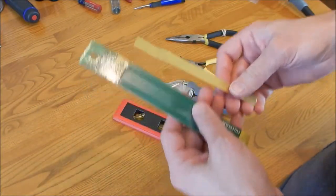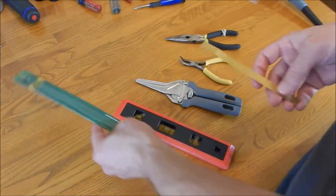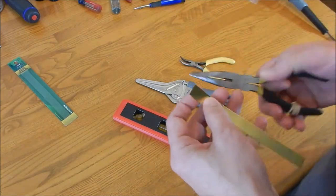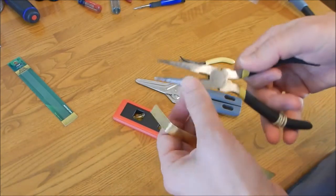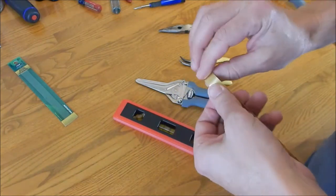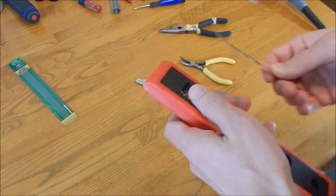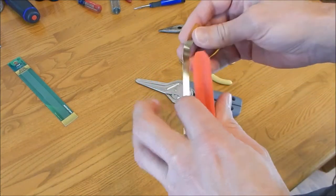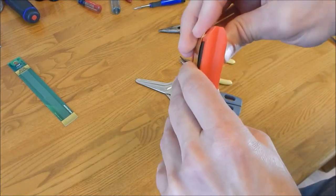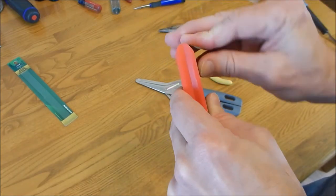Okay, so I decided to make a quick clip of how I actually went about making the battery terminals with the flat brass. I know people need it for ideas or they're curious. I didn't want to use metal needle nose pliers because the edges are really sharp and tend to scratch up the brass. I wanted more of a curvature to the terminal, like a regular battery terminal has. So I found this level with plastic beveled edges, and I was able to start shaping the brass around it, and gradually made a curvature to it, like you would find on a normal battery terminal. That was actually quite easy, and didn't take very long.